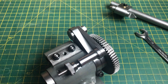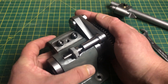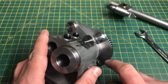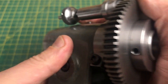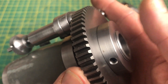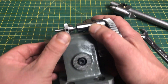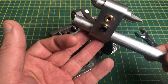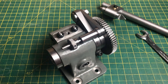All in all this has been a really pleasing set of components to machine. I'm really tempted to put this gear onto the rotary table to drill the holes so it does become functional, but I will restrain myself and wait until I have some of the division plates that will allow the holes to be drilled in situ as suggested in the book. What I couldn't resist doing is taking a very light facing cut off the sides of the wheel and adding a shallow chamfer to both sides of the teeth, which I think improves the look significantly. I think that brings part 5 to a close. Next time I will be completing the ball handles that will replace the cap screws in the spindle and tailstock locks, so please look out for that if you're interested. Do leave any thoughts in the comments, subscribe if you want to see more, and hopefully I'll see you again. Cheerio!